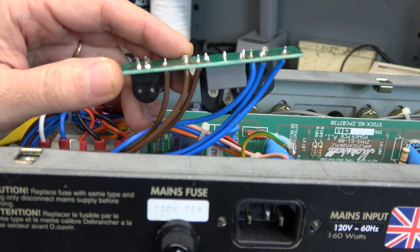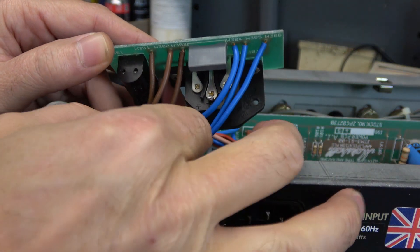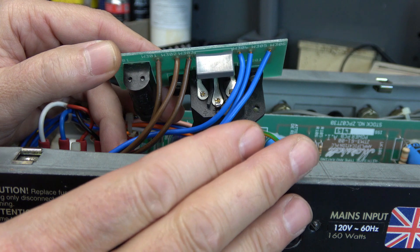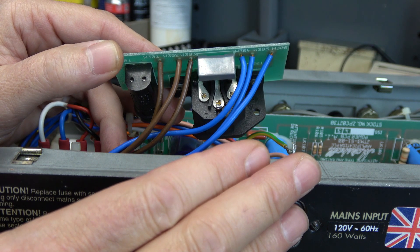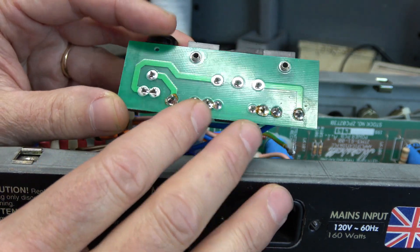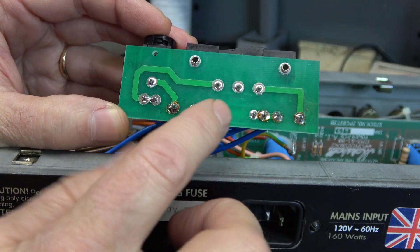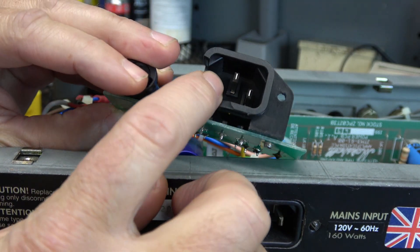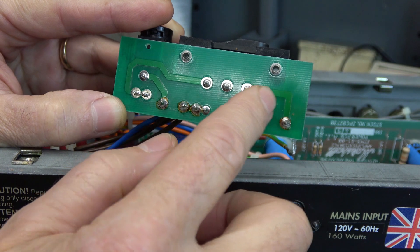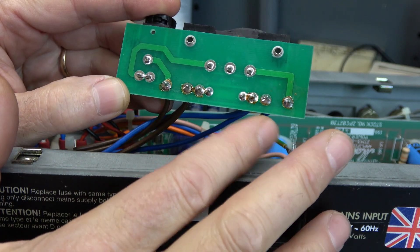Let's take a closer look at the circuit board so we can understand everything that's going on. You'll see we've got six wires total here — three browns, three blues. You're wondering why would you have six wires to turn on and off the AC — you'd expect to see maybe a neutral and a hot and it would go through your fuse holder. So let's trace this out. The brown wire here goes up through the fuse holder then through that trace to this prong of the AC outlet. Then this blue wire over here also goes up through this trace and goes to that prong. So those two are the AC input.